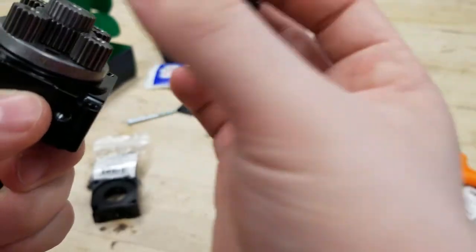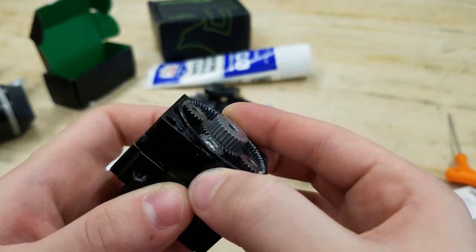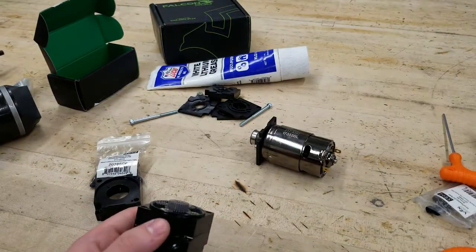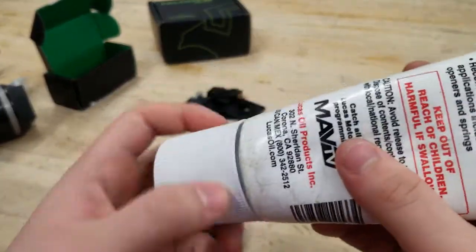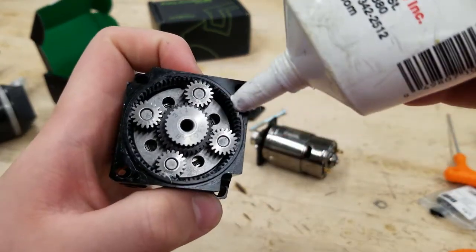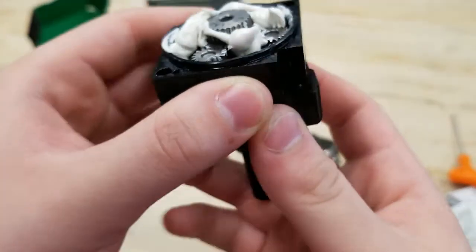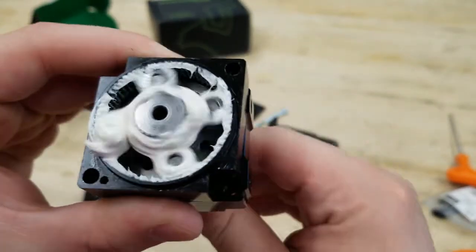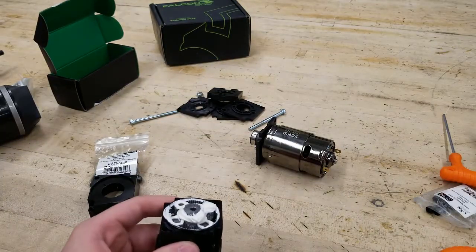Okay, so let's put together the gear ratio onto the output shaft gear. Just for the sake of terminology, note that the gears which run on the outside are planetary gears and the one in the middle is a sun gear — cute, right? When the ratio is in place, we now place the ring gear — the square black stage — around this. You may need to wiggle this around to get the fit just right. Always apply a copious amount of white lithium grease when assembling a new gearbox, and give the output shaft a few spins to work in the grease. If you are making a two or three stage reduction gearbox, go ahead and repeat this step with your other ratios and ring gears.